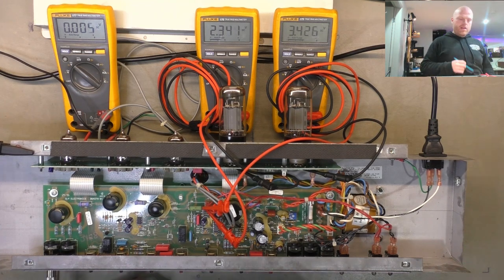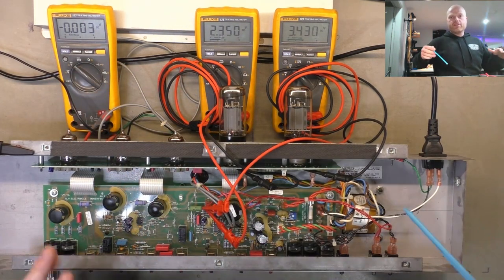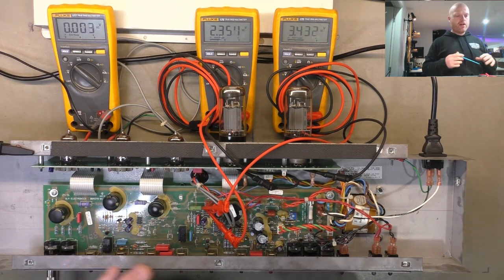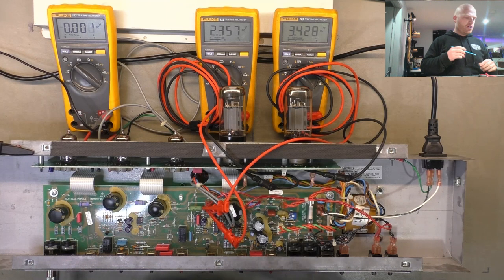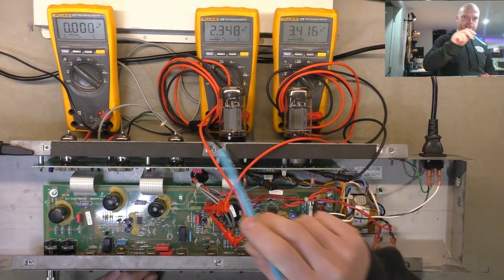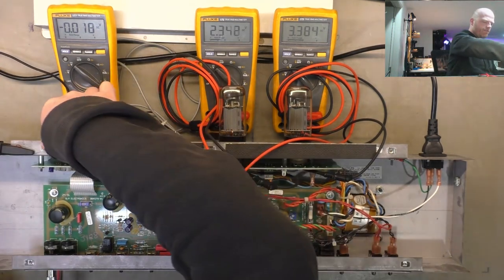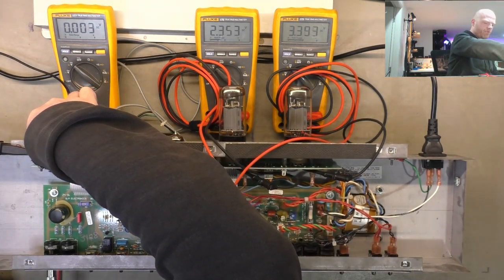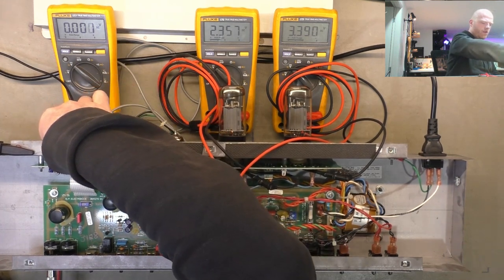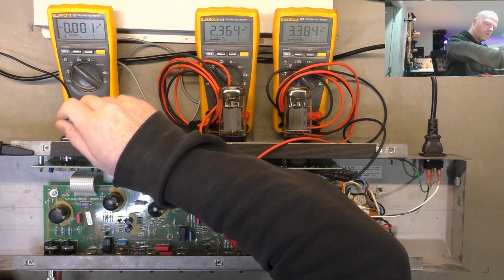All right, so before we go cleaning the pots and stuff, we'll just check for microphonics, anything else that we can address. We just want to turn this off, address everything, try and hit them all, and then fire it up and leave it under test for a long time. So we'll test for microphonics and I'll calculate where we want these to sit given the higher plate voltage than expected. We've got some fluctuating noise happening there. I think the valve sockets and pins need a bit more of a clean. No dramatic microphonics. That's cranked.